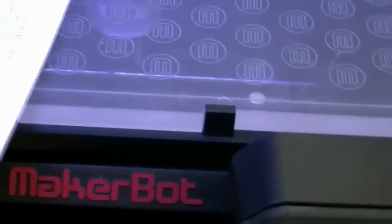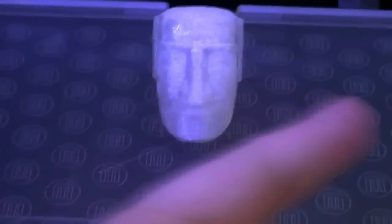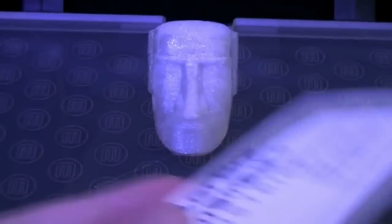there are more and more risks that the extruder head meets something during the printing process. And since this printing process consists in building an object layer after layer, if the extruder hits one layer, there is a shock, and the printer head is blocked, and everything can go wrong then. So truly, don't let any kind of friction happen, in fact.